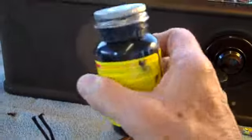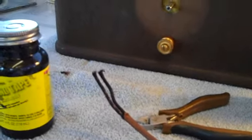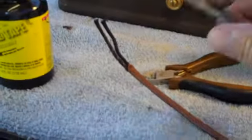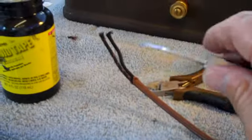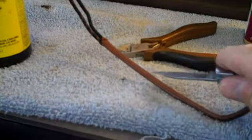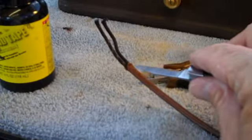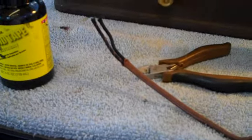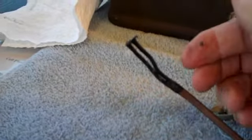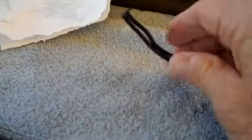So what I'm going to use instead is good old trusty liquid tape. I'm going to take the liquid tape and put it on the end of my knife blade and kind of spread it around - all the way around that thing. Then wait until it's almost dry and take my fingers to shape it, and that'll prevent it from fraying anymore. You don't need to go all the way down the whole wire - just about a quarter inch down and a quarter inch up, just to keep the cord from fraying. That's important. Now we take our fingers - it's just about dry - and shape it all the way around as flat as we can, squeezing it down into those fibers. Wait until it's dry enough so it doesn't come off on your fingers, then let it dry a while longer.